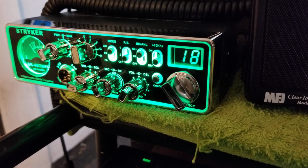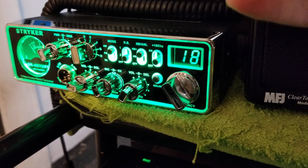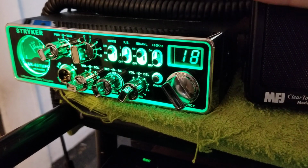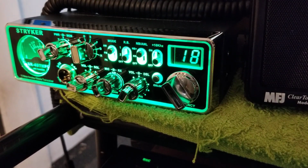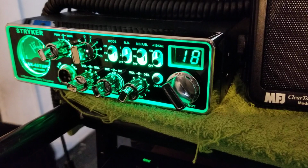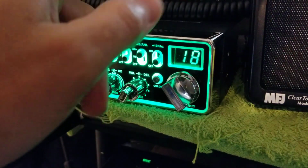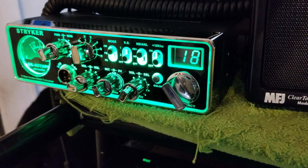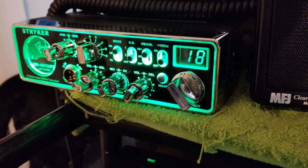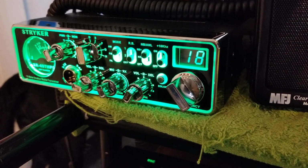I just let you know, 3 different microphones, 3 different audio levels on the output, 3 different power levels on the output. It's all going to make sense in the end when you get a tuned radio and a tuned system. A good tech can make pretty much most of these radios work. Most microphones work with the radio, but it requires more than just an alignment. It requires them to go in there and modify the input circuit and make it work properly. So that's just a quick overview of how different microphones affect your radio and your output and your power.